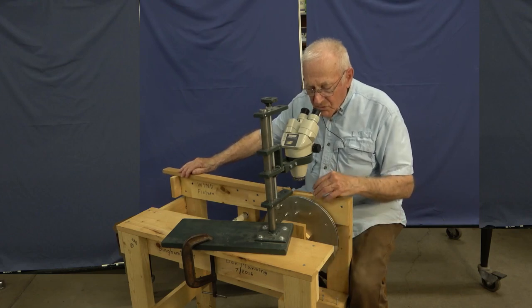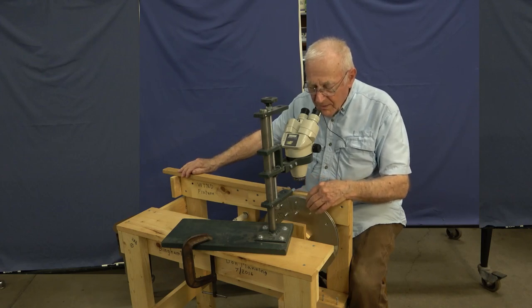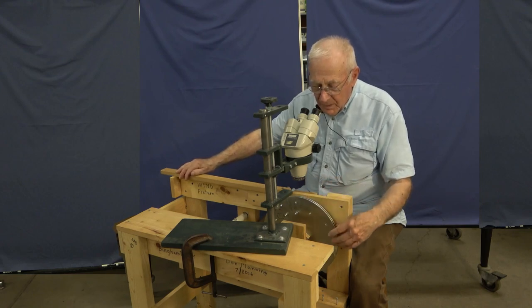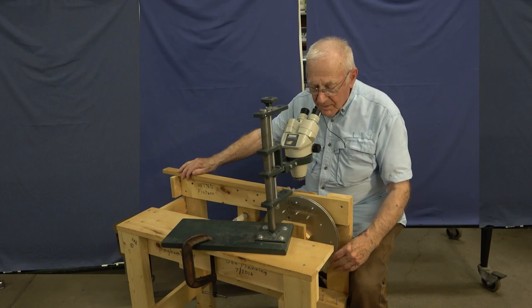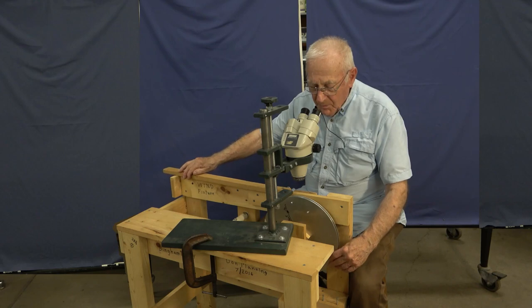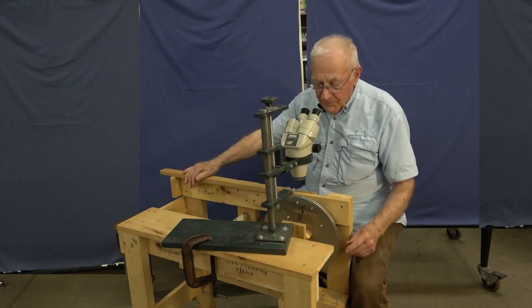And then once you get your terminals on, you take the wire, and there's a small spot in that first plate that you can stick the wire through and tape it fast and cut it off, so you have control of the wire. So that's the way you lay the wire down, consistently, next to each other, in a continuous operation. It takes a while, but if you do it slowly and with control, you can do a good job, and it should work well.